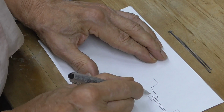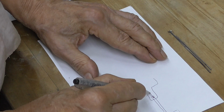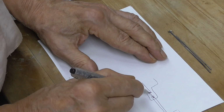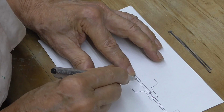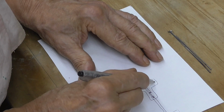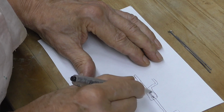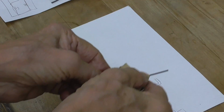And then in the pinch, we're going to put a piece of tungsten wire for the seal, and then another piece of heavy wire coming on out, and that's going to be for our connection for our RF stuff. And this will be solid glass here. All of this will be solid glass. I'm going to go ahead and clean this up.